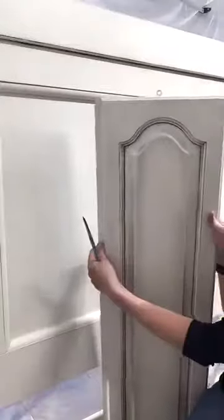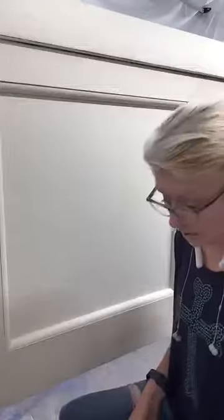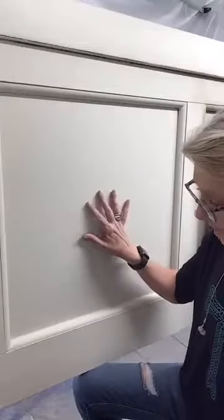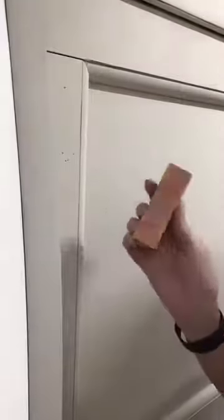The way that we're going to create the finish from the cabinet door — I'm sorry my lighting's a little off this morning, I'm in my paint booth, my happy place. I did a base coat, two coats of drop cloth, let it dry completely, and then one little trick I wanted to show you is what I call my PB distressing. You can see right here on this line where I have just taken my little zip sander and done a straight line, just to give this a little more shape and movement.